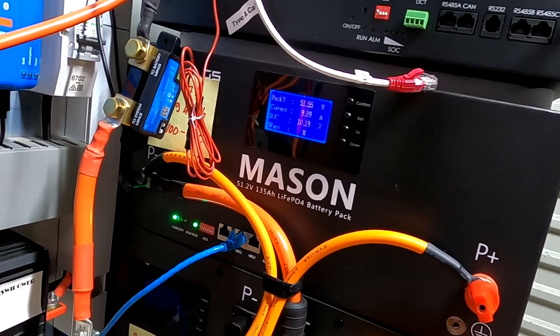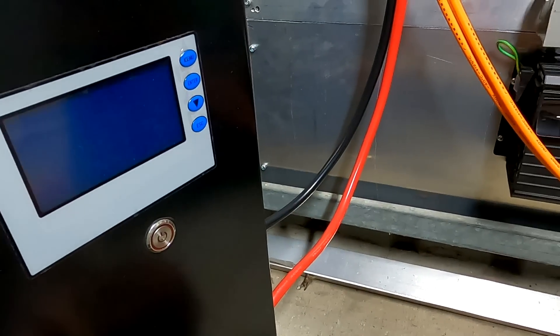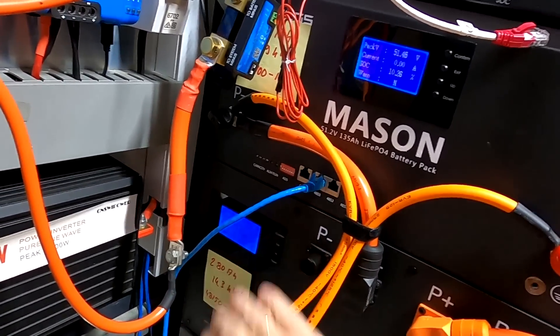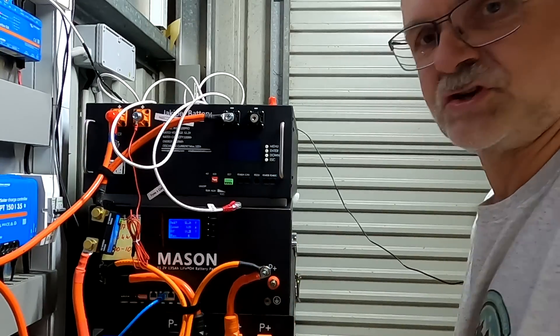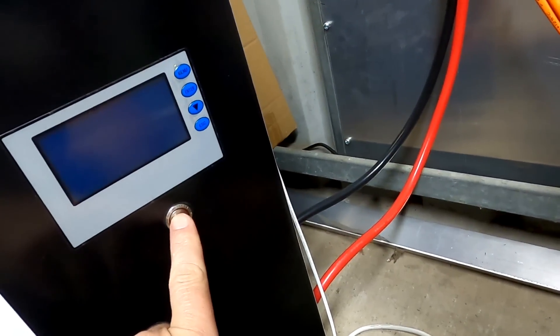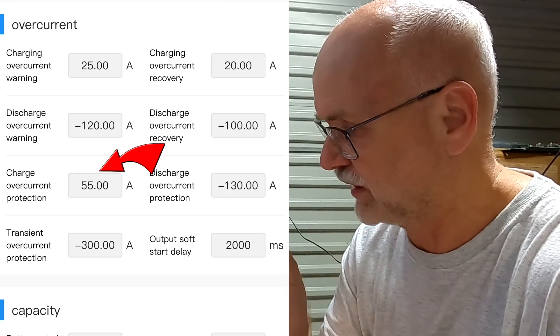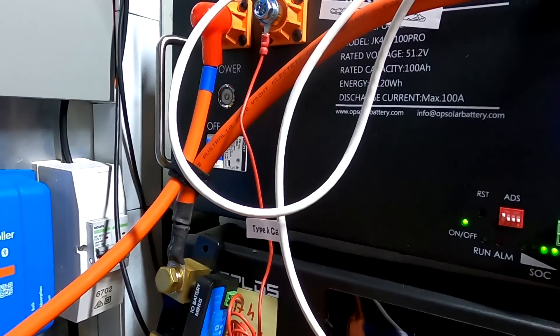So that is good to know — even in the old 10C BMS with CAN functionality, the current limiter kicks in if there's an over-current alarm. Let's turn off the QSO battery. Now let's do the same with the larger Seplos 280 amp-hour battery — our good old battery number one. Quick and dirty connection. The big battery is connected. We need to check the settings first because I think this one is set to 150 amps — we'll never reach that. We've got a warning at 25 amps and a disconnect at 55 amps, so we can see if it triggers at 25 or only at 55.